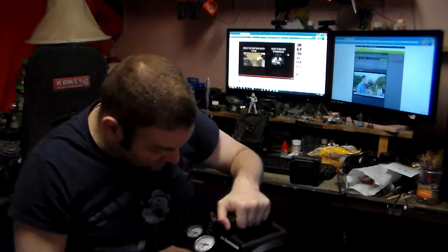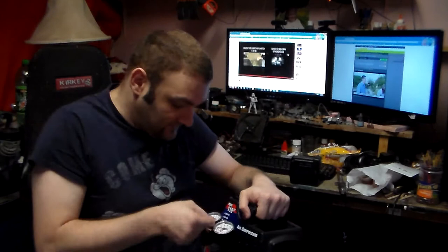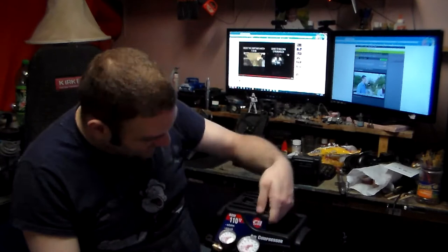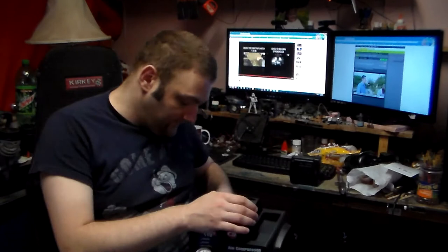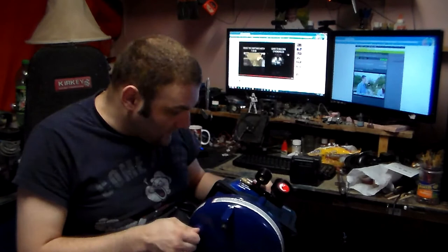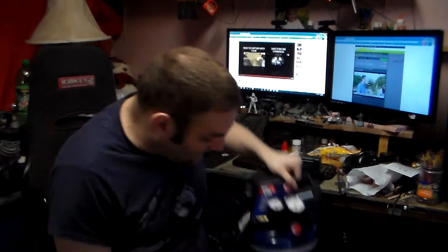Well, apparently it was tested. And it has a pressure regulator on it. PSI coming in, PSI going out, so I can set the PSI to whatever. I hate that sticker, so we're going to peel this off. Of course, it has your bleeder valve here, so you can empty out the pan. Typical 120 outlet wire, nice thick gauge. Looks like it's got no, oh, there is a drain plug. There is a moisture drain plug. Nice. Looks like it's all been well constructed. I mean, there's nothing coming apart. See, give it a good old hefty shake.